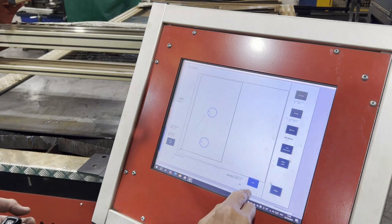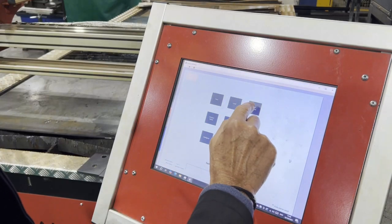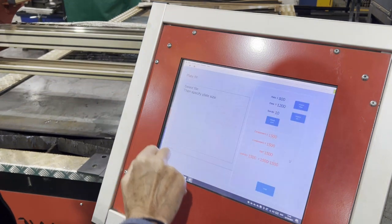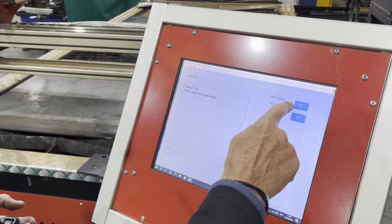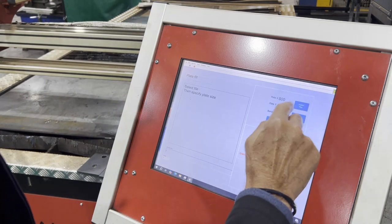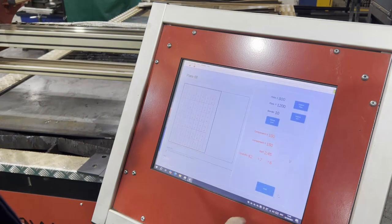What we want to do now is turn this into an array. So we exit that and go to Scan and Nest — this is our utility screen. Plate Fill is our name for array, so we select Import Flexi. This is the flexi shape we've just created, or we can import an NC1 file directly. Again, it needs to be a square or rectangle — we can't have corners or radius anywhere. Import Flexi, most recent — so Array Video.